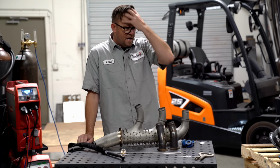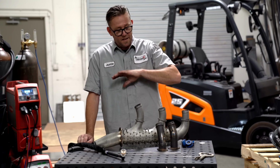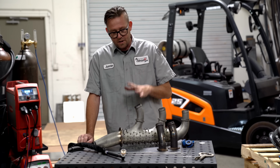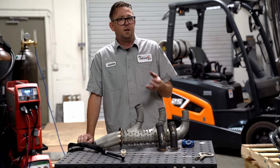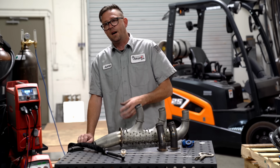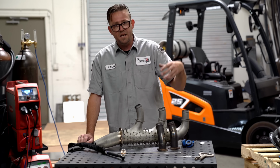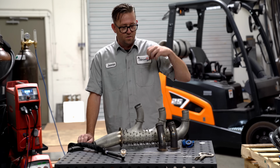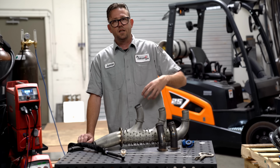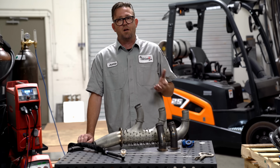Okay, so I haven't reviewed the footage. I have no idea if I was even able to demonstrate how much of a struggle this job is. And all of the things I called out in the beginning were definitely a problem as I was going through it. So the media blasting, the fatigue of the metal, all of it being heat cycled. You saw how much effort it took to clean and prep these to get them back to bright metal to become welded. There were layers of oxidation on this part.